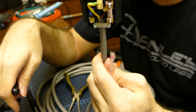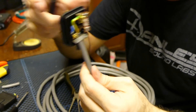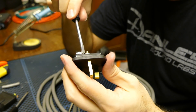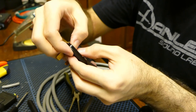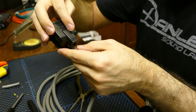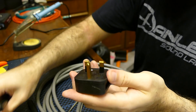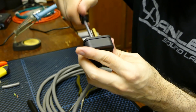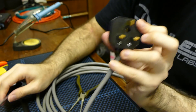That is your plug completely wired. Go back around with your screwdriver and tighten up the terminals one last time, then you're good to install the outer cover. Install the main body clamping screw and we're good to go. Now let's install the socket.